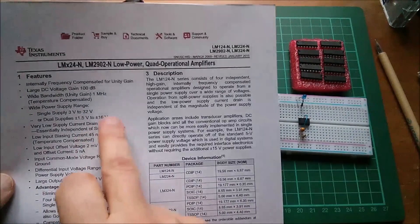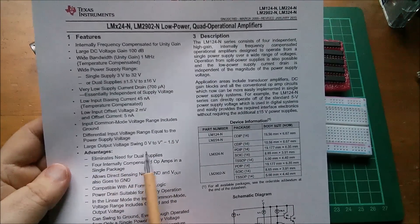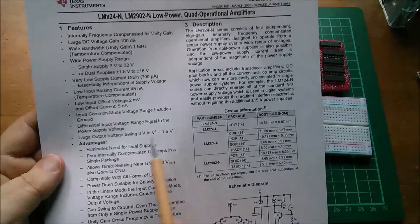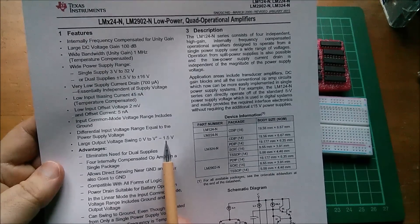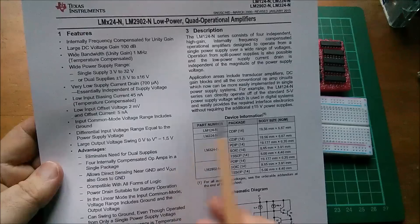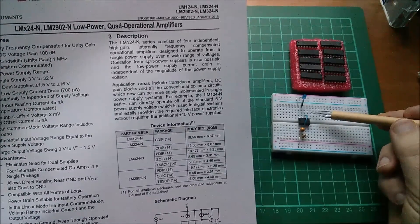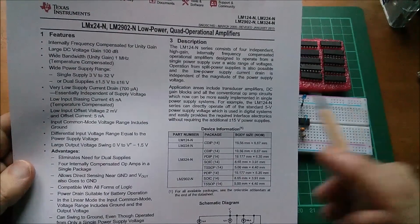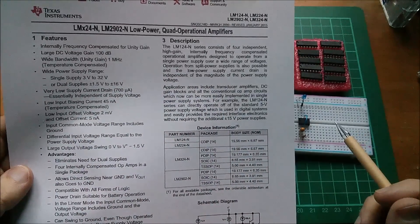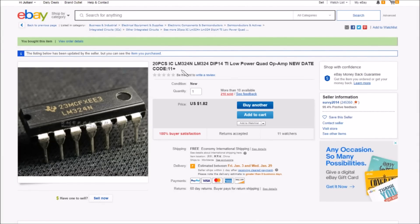With everything operating at five volts this should work. It does say here a large output voltage swing from zero volts — right down to the zero volt rail — to V+ minus 1.5 volts. So if V+ is 5 volts, the output only goes up to about 3.5 volts. That might still be okay for driving pin 5 of a 555 to vary its time period — we shall have to see. I've never really played with the LM324 before so this will be interesting.